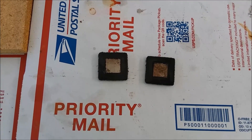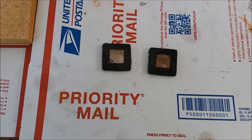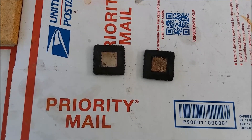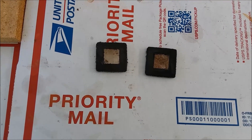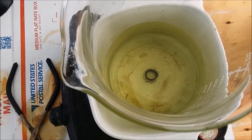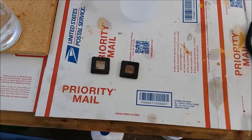Processing all the base metals from all ICs is not worth it. Take a close look at your leftover base metal debris - use a hand lens or loupe, wash it clean, and see if you can see visible gold. If so, process it; if not, just discard it, because likely all you're going to get is a couple cents worth of gold after using five to eight dollars worth of chemicals and a couple days of time. Thanks for watching.